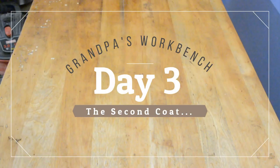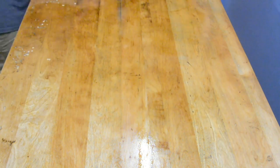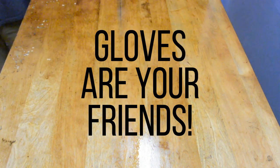Day three, and we're putting on the second coat. It's 26 hours after the first coat. You have to wait a minimum of 24 to make sure that that coat cures completely before you can put on the next one. And please note that this time I'm wearing gloves because the first day I learned the lesson the hard way. It took forever to get that stuff off my hands.